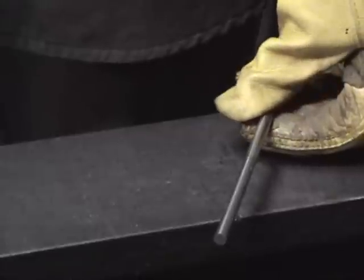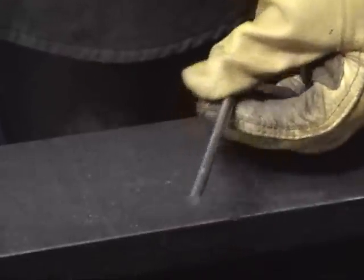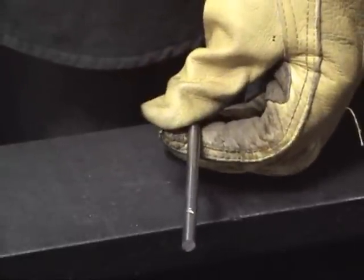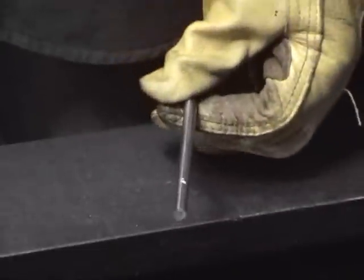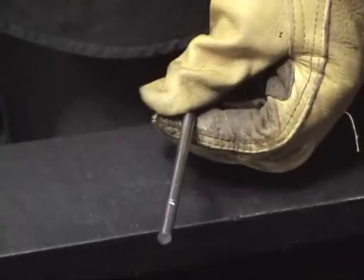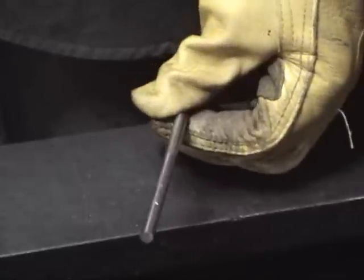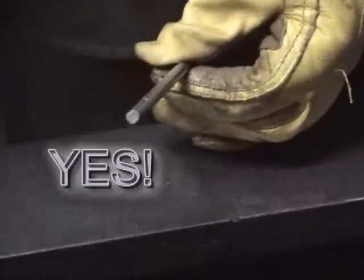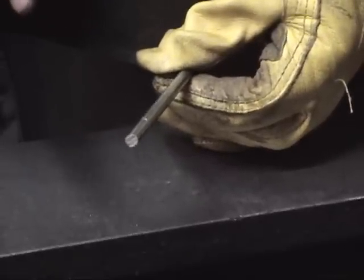So most people have heard the terms quench and temper. Temper is the one that I think people think of the most when they're talking about hard steel or soft steel. Tempering doesn't make things harder. Tempering makes things softer. To be very specific, the way the process works is when you heat the metal up to a particular temperature, called its austenitizing or martensite temperature, there's a temperature at which the molecular structure of the steel, am I boring anybody yet? Moves apart enough, the atoms move apart enough that carbon atoms can move into that lattice structure.